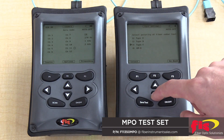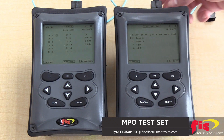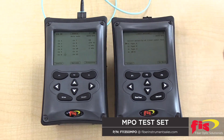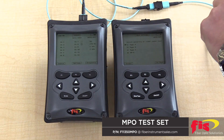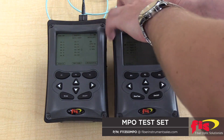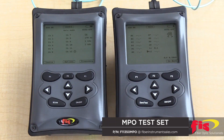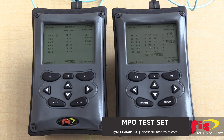When referencing is finished, introduce the test cable, then select the polarity of the test cable to start the loss test. Within seconds, you will have all of the 12 fibers' test results displayed and measured against the user-defined pass-fail thresholds. Finally, to save test results, simply press F1.